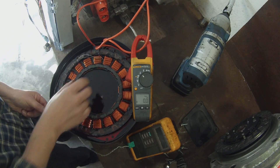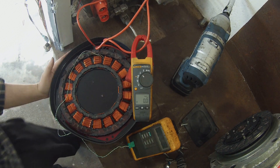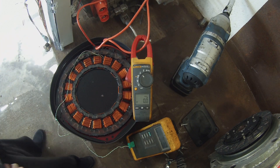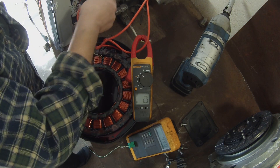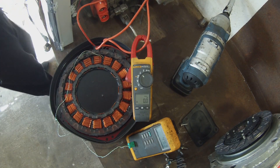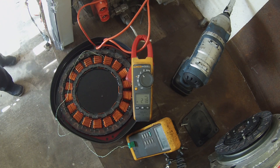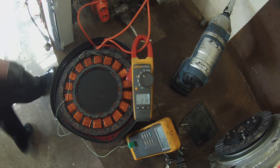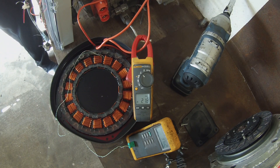Let's get a temperature — some of the windings are definitely warm. I'm reading 50 degrees centigrade in there. Looks like we're oil-cooling this inductor. That's very interesting. I think this is one of my current sensors — let me scope it for a second. Okay, I have a current sensor reading on the scope showing a very nice sine wave going in there with 20 amps. I want to see if we start getting distortion in the sine, which would indicate we're saturating our inductor load — which we probably are.